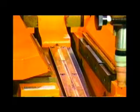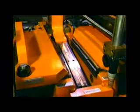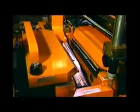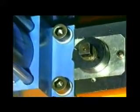There is no need for the operator to handle scrap coil ends — this is one of the many unique features of the zip welder. Also, notice that both coil ends are clamped very close to the sheared area. After the shear returns to the clearance position and the side guides are opened, the entry and exit weld clamps remain clamped and index the material to the weld position. The amount of index is controlled by mechanical stops, which are adjustable to allow for the proper gap or tight fit for welding.